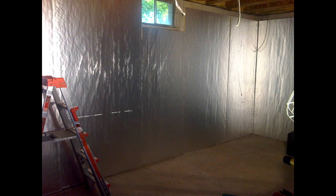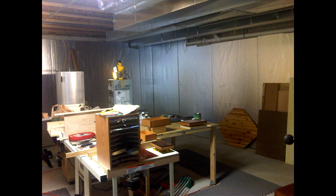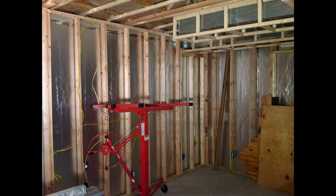Both the walls and the floor are poured concrete, so step one, I started by covering the walls with foam insulation material. In addition to covering the walls, I also taped all the seams, and once that was done I began framing out the space — both the walls, the ceiling, and all of the soffits around all my HVAC equipment.